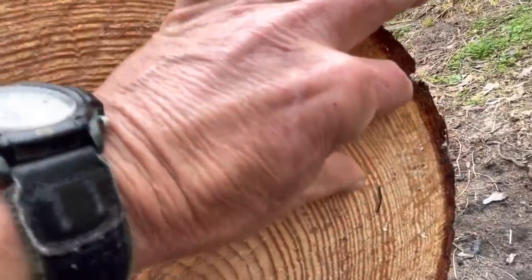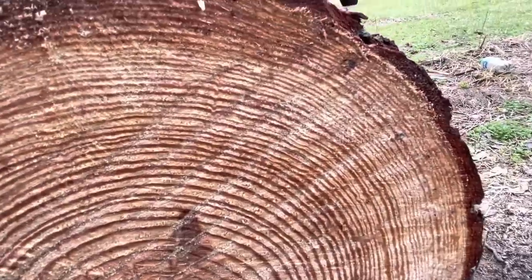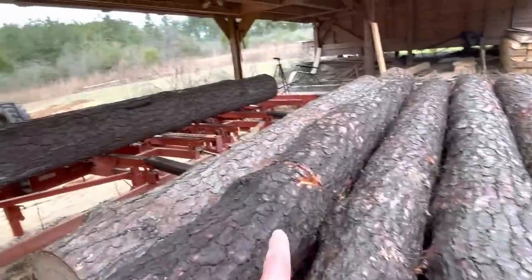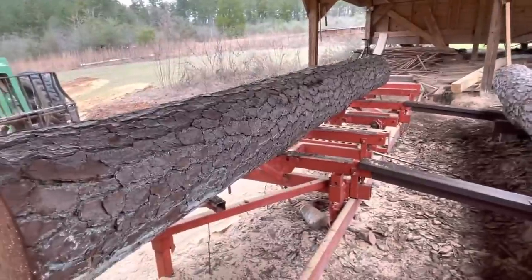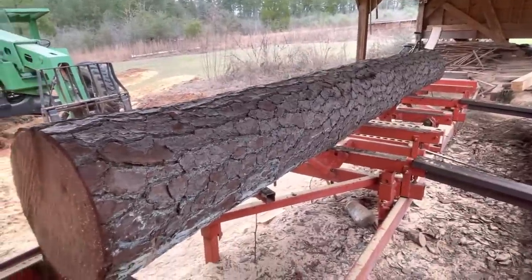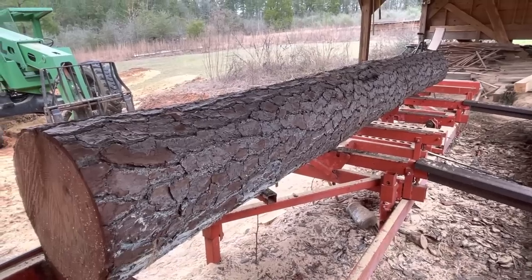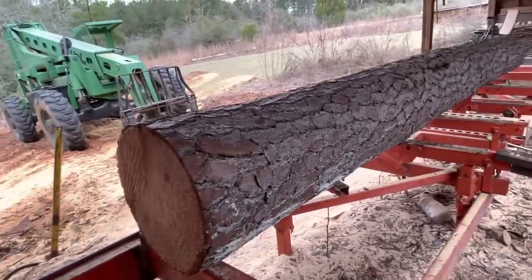So you can only imagine when you take a board out of something like this — look at how much grain you'd have in that. That's why I picked these trees to make those rafters, because they're going to be loaded up being eight feet apart. But they're going to be five inches thick and ten inches wide — each rafter, each beam, bottoms, tops, even the braces. Everything's going to be heavy duty and bolted together, so we'll handle ice, storms, anything. An oak tree falls on it, we're going to hold it up.